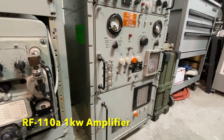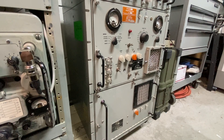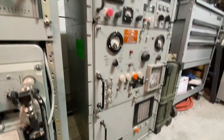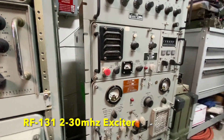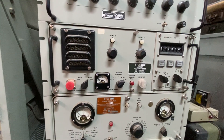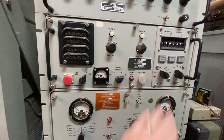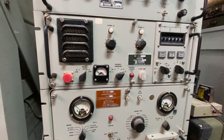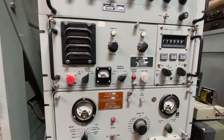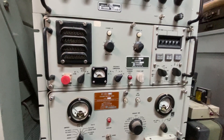Then you've got the RF-110 amplifier — it's good for HF and is a very robust amplifier. Above it is the RF-131 exciter, which in the Navy would have been a T-827. It's from about the early-to-mid 1980s. As you can see on the controls, it's good for upper and lower sideband and also does independent sideband. It does CW and RTTY, which requires AFSK input. Unlike the T-827, this one does not have a loop input, so it has to be driven by audio.